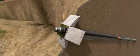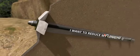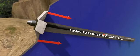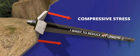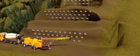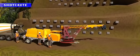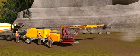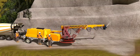The steel tendon in tension wants to reduce its length, but the block is not allowing that. This means the concrete block will press the slope inward. This compressive force will greatly increase the stability of the slope. Their next technique is shotcrete. Using this special machine, concrete is sprayed on the mountain rocks. This technique increases the stability of the mountain further.